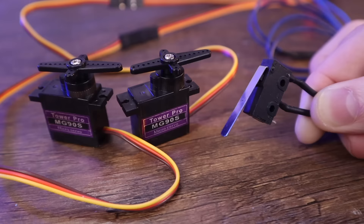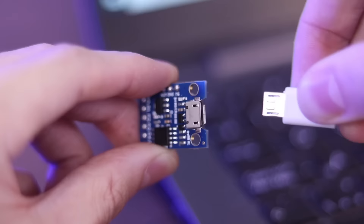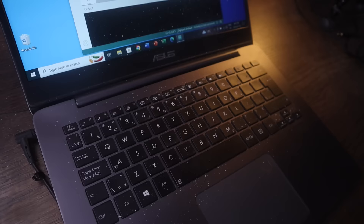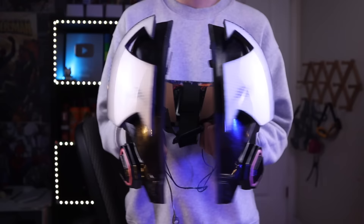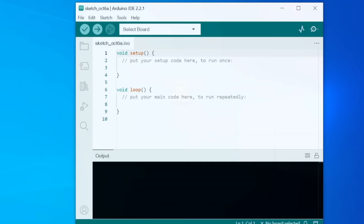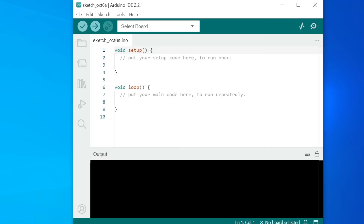This is the opening speed, and this is the closing speed. At some point, I made one more small change to the code in order to make the mask close a bit more slowly. This is because the servos were rotating so fast that the two halves would tend to bounce off themselves instead of the magnets grabbing onto each other. I probably should have made the mask open a bit slower too, but that's alright. If you're interested, I put together a three-minute video that shows exactly how I edited the code from start to finish — it's available on my Patreon for the $5 tier.